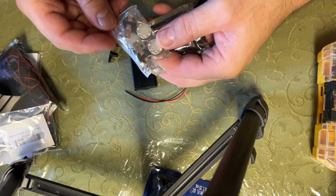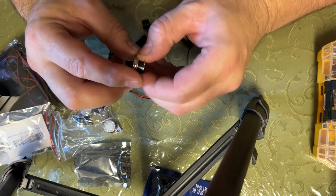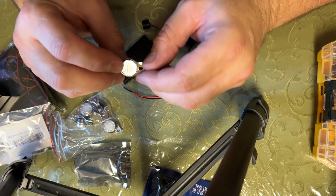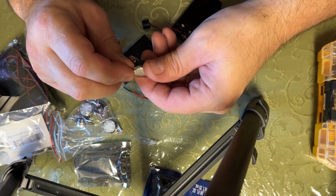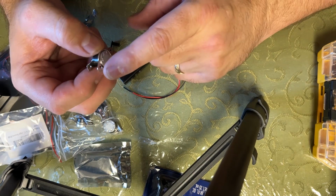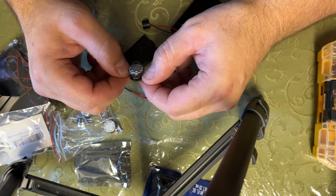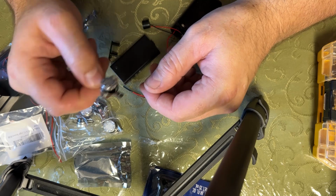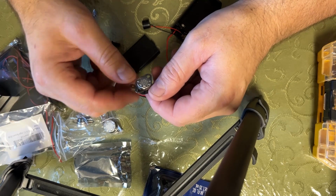Now this is a 0 degree thermostat, auto resetting. Ideally what we would want to do is tie this onto the freezer, drill a hole through the side of the freezer, but nobody wants to drill a hole in the front side of their freezer, right? What I'm going to do is probably hook this onto a piece of aluminum or something. For now, it's probably just going to be hanging down inside the freezer. We'll test it: put it in the freezer, let it get down to zero, pull it out, let it set off the alarm, then put it back in the freezer again. Let it get down to zero, pull it out, test the alarm.